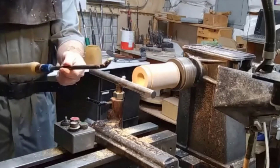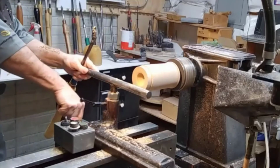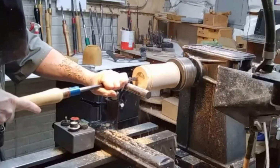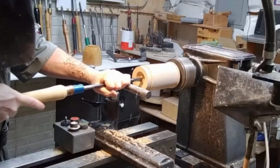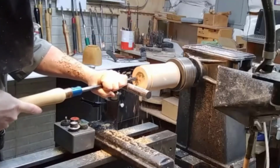Now I'm switching to the woodcut tool. Again, this is great for end grain boxes like this, but it's not quite as good for hollowing, or I haven't figured out how to use it for hollowing, although it can be done. But this is producing shavings instead of sawdust. And on good green wood like that, this piece of Bradford pear here that I cut when the wood was exceedingly wet, you should have seen the shavings flying off of that. They were like, wow. I mean, it cut like butter and hollowed out that whole thing in a few minutes.